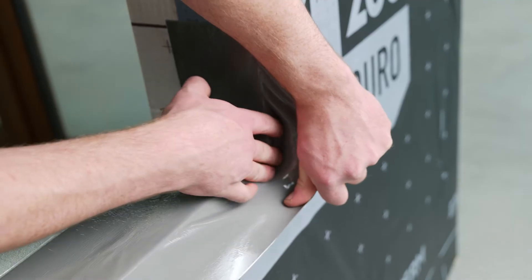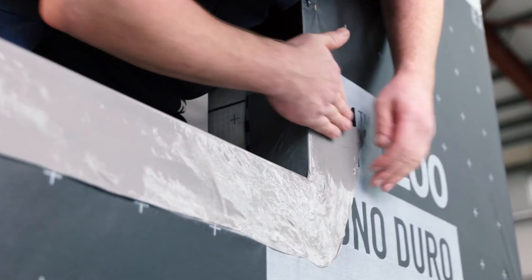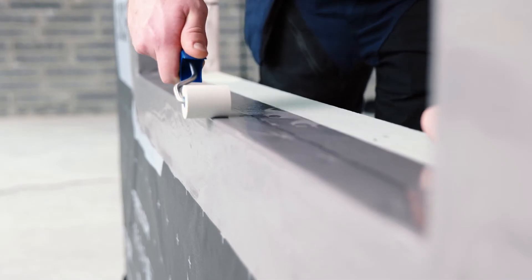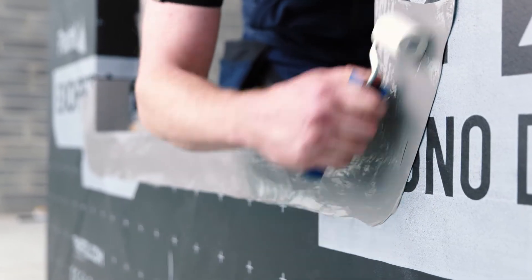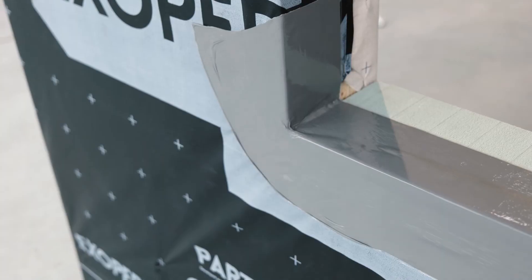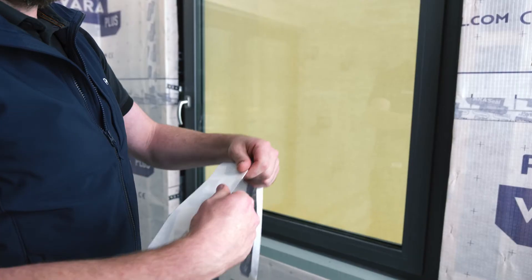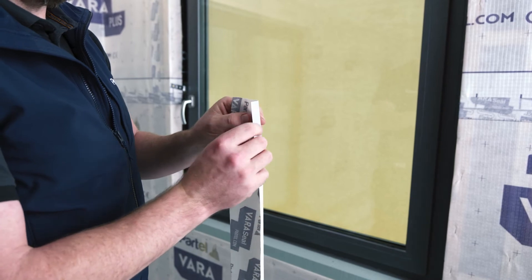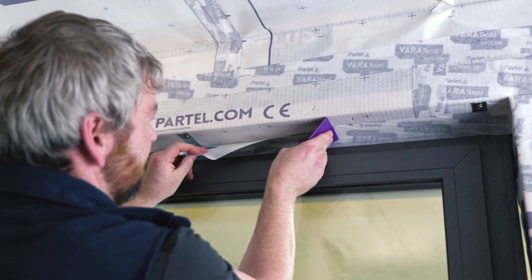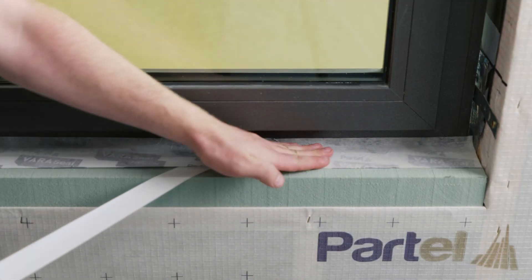Conlex is excellent for irregular shapes that require greater elasticity of the adhesive tape. Installing airtightness tape before the window is installed is the preferable method of achieving superior airtightness. When using the tape roll applicator, sufficient pressure is required to ensure a long-lasting bond. The air sealing around the window is made using VaraSeal — tape to the surrounding membrane at the corners and press tight. Once the window is installed, the tape can be bonded directly to the internal vapor control layer and AlmaVert structural insulation panel.